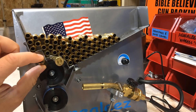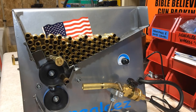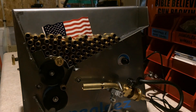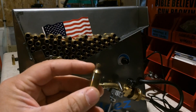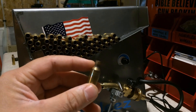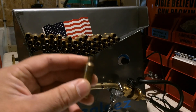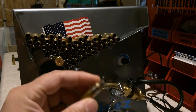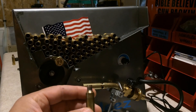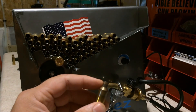Also, when setting up your torch and speed control with test brass, you have to have it somewhat dark in the room. You don't want it pitch dark — keep safety in mind — but it needs to be dark enough to keep an eye on that glow. Also keep an eye on the color of the flame: if you start to see any orange or yellow burning off the brass itself, that means you're burning elements out of the brass you do not want to burn out. Short and simple: the second it starts to glow, get it out of the flame.